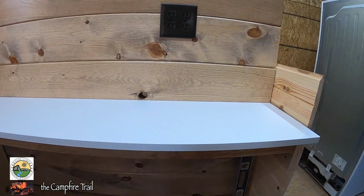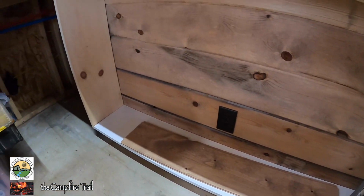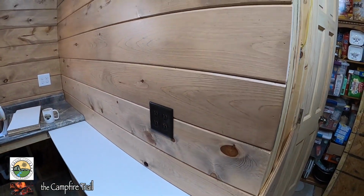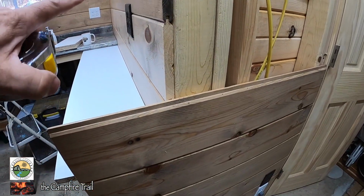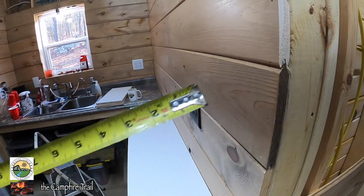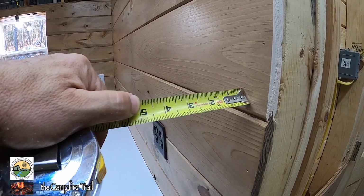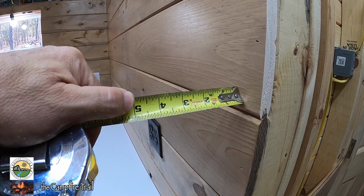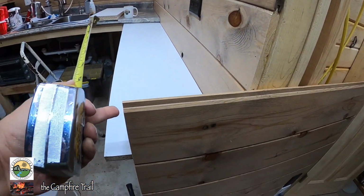Okay, so right there is where that shelf will go, and as you can see down below, we're going to have room to build about 8-inch wide shelves down here. There's the kitchen wall, and we're going to come up about 2 more panels here to get up to about this spot roughly, and from that point up we're going to be doing some shelves that are about 5 inches, so they'll be out here about this far. And that'll make up some of the kind of just food storage and things like that shelves for the kitchen here. And I want to come up straight with this.